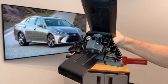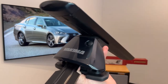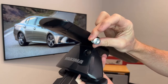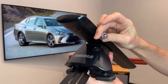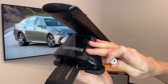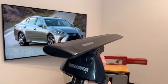You can go ahead and put the cover back into place — it connects at the bottom and snaps at the top. You'll notice a plastic plug on the cover; that plug can be replaced with a Yakima SKS lock core. These cores are sold in matched sets and separately. SKS stands for Same Key System, which means you can have all your towers, accessories, and carriers key-matched for convenience and ease of security.